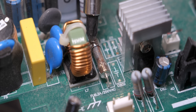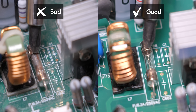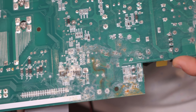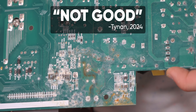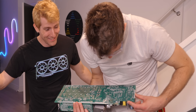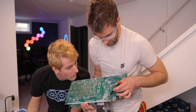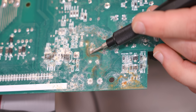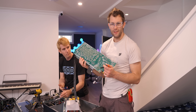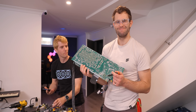Getting a closeup of the two fuses — here's the blown one versus the good one. Oh, there's your problem. We found it. I can actually see where some of the electricity was breaking through the solder mask around the edge of the trace. That would have electrolyzed the water. So this fuse probably tried to save everything else, but it was completely soaked in water and never stood a chance. Thank you for your service.